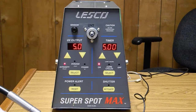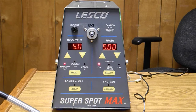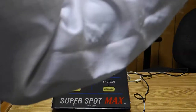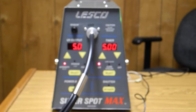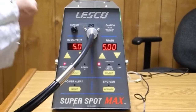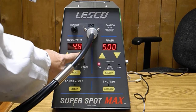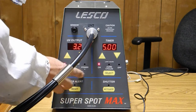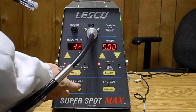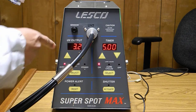Now we're going to verify if the optical feedback system is working. To do that, we take out the light guide — actually take out the fiber — and plug back your light wand. Starting at the lowest intensity level, let's go to the lowest, which I believe was three point two five. Set it for some convenient time — five seconds, four seconds, whatever. We've got it down to the lowest intensity, three point two watts per centimeter square.